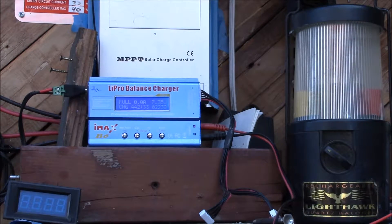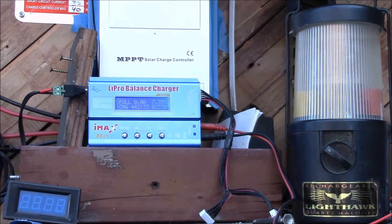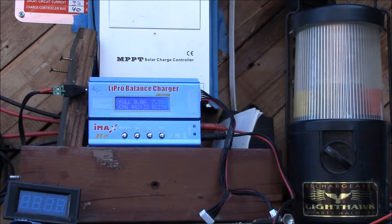The 6-volt lead-acid battery in the lantern is now charged up. It looks like it was about half discharged — it took 2238 milliamp hours and it's a 4500 milliamp hour battery. I charged it at four tenths of an amp and it took about seven hours total. That's much quicker than the original battery charger, which would take several days to charge.